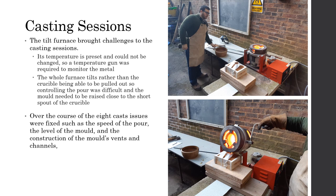The main issues with the casting sessions, aside from a lack of experience, stemmed from the tilt furnace. The machine only had an on and off function, rose to about 1,400 degrees Celsius, so to measure the internal temperature an infrared thermometer was needed at regular intervals. As the whole very large crucible tilts on a lever rather than being able to manually lift it out and pour, it presented a number of issues. When tilted, the spout was very high up, so the mold had to be placed on a series of wooden planks so that the metal would be less exposed to the air, and it took a number of tries to get the right height. In the first cast, the mold was too high and the spout of the crucible hit the ceramic funnel and ruined the pour. If the mold was too low, metal would cool on the spout and obstruct the rest of the material in the crucible as it poured out.